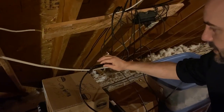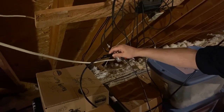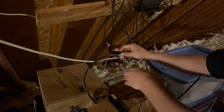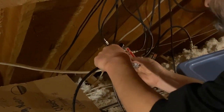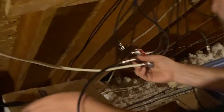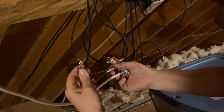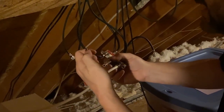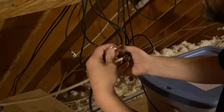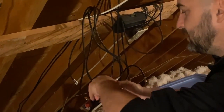This is the input — what's coming in from the ground block. So I'm going to put my meter down for a second and just come in here and see if this is loose. Without even needing a screwdriver, I can tell you right now that this is absolutely loose. It was hand tightened on there. Furthermore, that looks like a good connector, so everything looks good in there — it just was not tightened down. I'm going to go ahead and tighten this down.